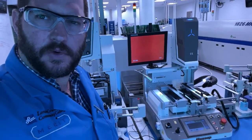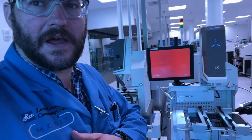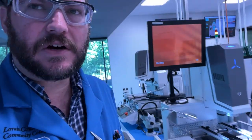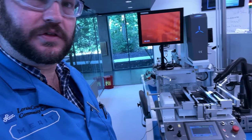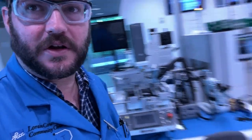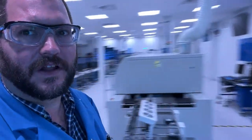Hey there, Johnny Vandervoort here, Lorain County Community College MEMS and Microelectronics Manufacturing Program, as well as MERIT, Manufacturing Electronics and Rework Institute for Training. We just got done training a couple of folks from a nearby company in how to do BGA rework using our NANCORP BGA rework tools — how to do placement of the BGA, what BGA is, ball grid array chip components, how to rework it, and also how to inspect reworks on our Creative Electron X-ray system.